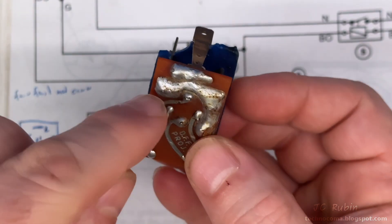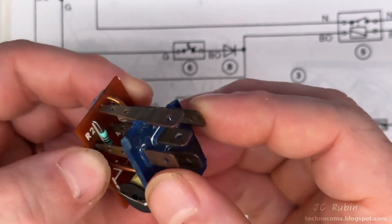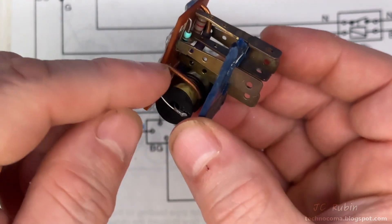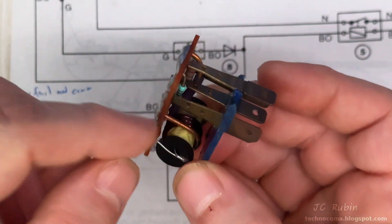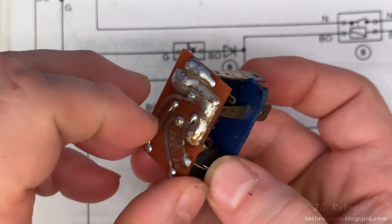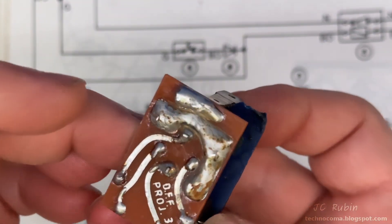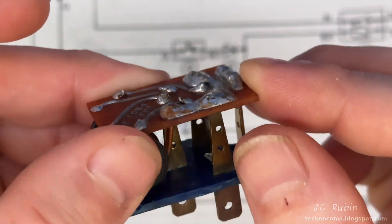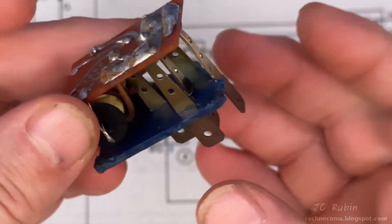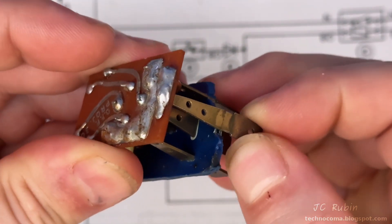It's a great idea but there's a fatal flaw. The incoming connection is right here on this pin, and the output is these two pins on the side going to their respective fans. To get from this input to this output it has to go through this thick copper cable, which wraps around a coil four times and is then distributed out to those two outputs. On the output we can see a decent amount of solder applied from repair to manage that current, but that input pin carries current for both fans and doesn't work well given the heat and vibration — there are mechanical problems with this pin. We can see it's probably not connected anymore.